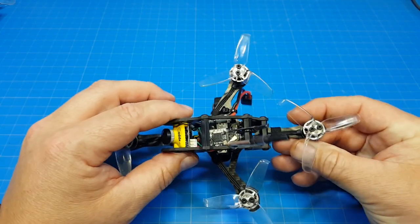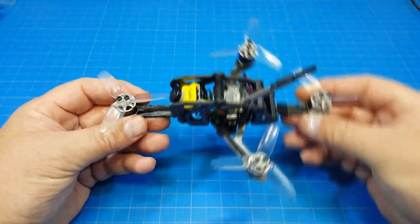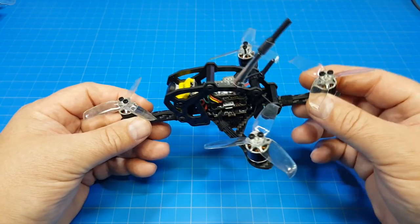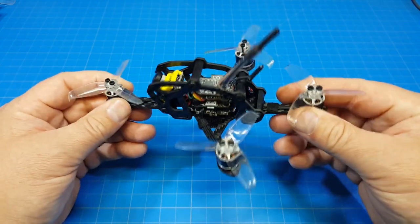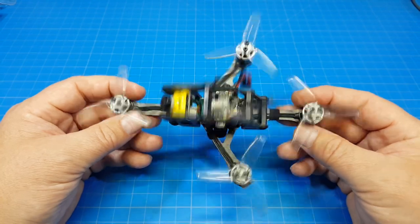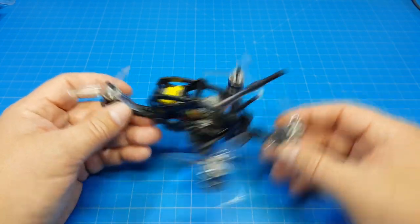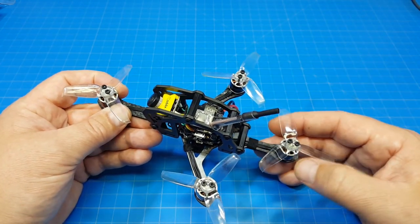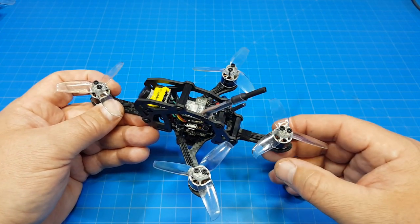And also in the flight experience, this is one that you feel like it can yaw and roll really, really well. The pitch kind of holds its course. So you point it in a direction and it seems to go there. And then it can be a little bit twitchy, I would say, on the roll axis. So you might have to change your rates on the roll axis a little bit. I didn't, but you may feel the need to when you build yours. And the yaw is something that's very interesting, because typically when we're flying a normal quad with 2 motors on each side, I find that my rear motors are oftentimes the motors that get really, really hot.